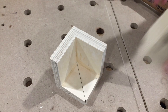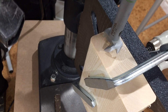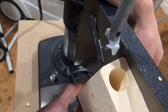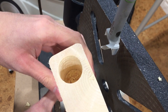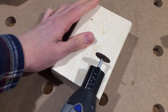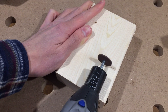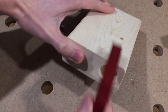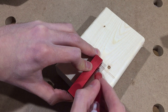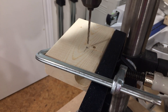I'll build the attachment out of a small 2x4 cutoff. The first thing is the 25mm hole for the Dremel. The right position of the screw guide hole can be tricky to locate. I used the Dremel to mark the expected depth of the cutting disc, then it's careful layout work with a square to mark the expected cutting edge. The aim is to expose exactly one quadrant of the screw to the grinding disc. When all that works out, looking through the screw guide hole, it should look like this.